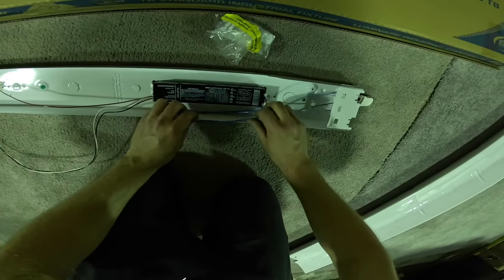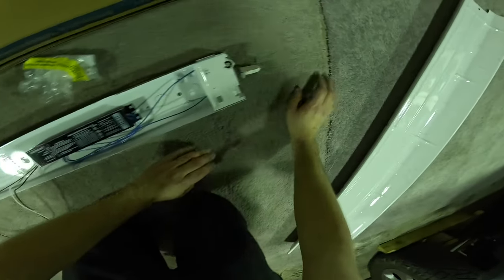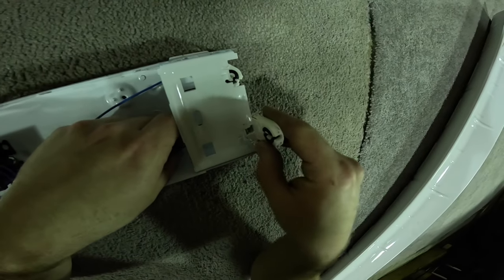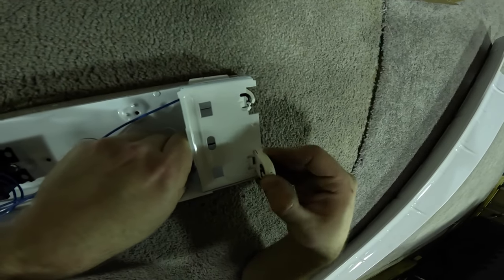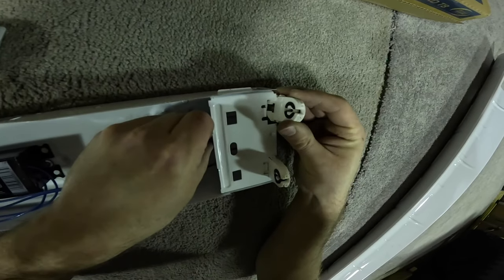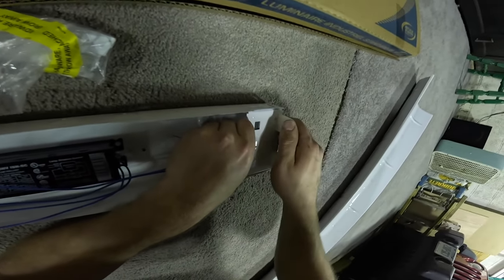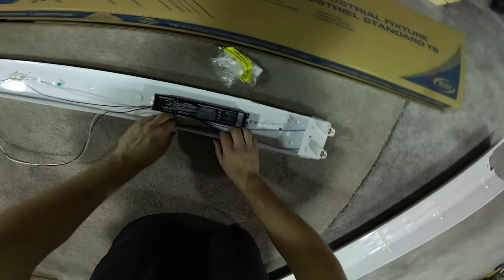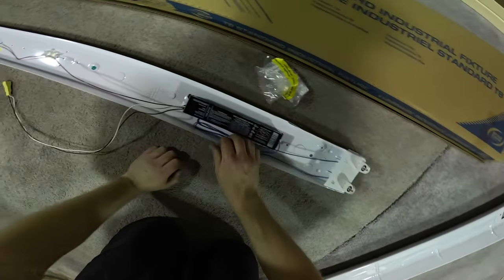So the next thing I need to do is start stocking up on these ballasts. Well, not this particular one. I don't like these ballasts. These are instant start. Try to find some rapid start ones. And I've got to start stocking the bulbs, which as of now are still available, but I think the next thing that's going to get taken away is anything with mercury. So metal halide, sodium, and mercury vapor and fluorescent and CFLs. I think those are all next to go. So I've got to start stocking up on those next.